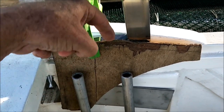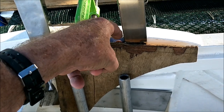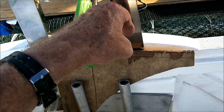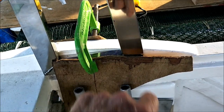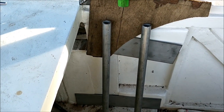There will be two five-eighths inch stainless bars going through here — I'm going to drill this out, weld it here and on the bottom. Those bars are going to be in line with the tube. It's not going to be welded on the surface — there's going to be a five-eighths inch hole, and the inside diameter is five-eighths inch so they slide perfectly inside. It's a perfect fit.